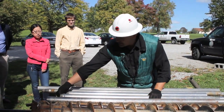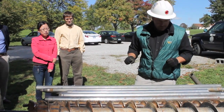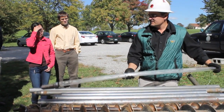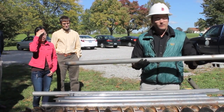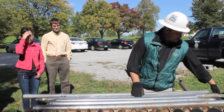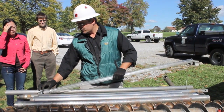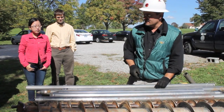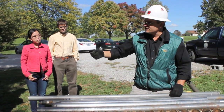This dual tube doesn't work very well if you get sand. If you hit saturated sand, you get sand between the two tubes, it binds up, and you're done. So I took off what they do in lake coring with pistons — because when you core in a lake, the muds are so soft the hole just heaves back in. So we made a piston. You drive a solid rod into the ground to the interval you want, and on the rig there's a winch where you hook this cable and pull it really tight, then you drill. The piston stays in place while you're drilling the casing or liner past it, and it acts like a syringe, sucking the sediment into the core. I've actually gotten three meters of pebble sand like this. Usually when you try to push on any sand, you're done — it's hard to direct push sand. You have to rotate it. But this creates a suction and actually sucks the sand into the core barrel. It works really well.